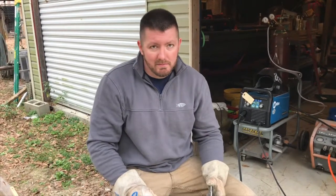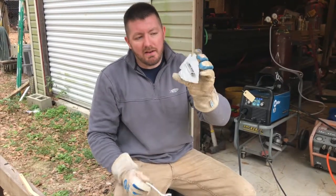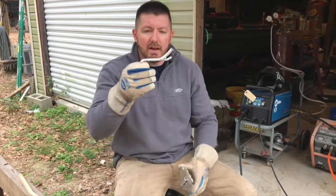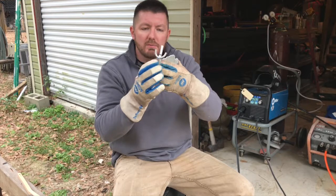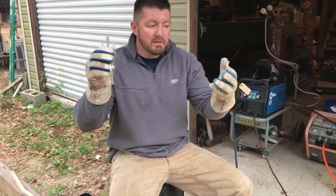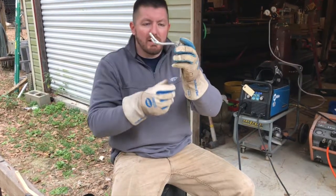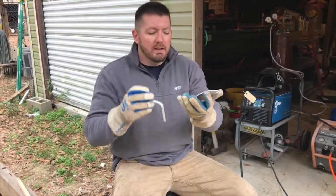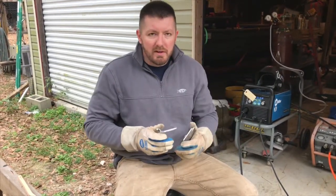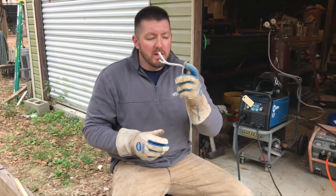Back at you today — ran out of gas the other day on my welder, had to go get some more gas and a haircut. So basically what we got now: you should have something like this. You got your arrowhead with your aluminum piece mounted on there, and then you got these. You weld the little hoops onto there just at the end like that, and that will hook behind those pieces. Now you got these two pieces — clean them up, wire brush, use a little sander to make it look like a brushed look. That will slide right down in there; you can turn it however which way you want. You can make this section as long as you want to get your head further away from the wall. You can beef it all up if you got a big elk head, but for a white-tailed deer, pronghorn, maybe a boar head — this right here will be perfect.